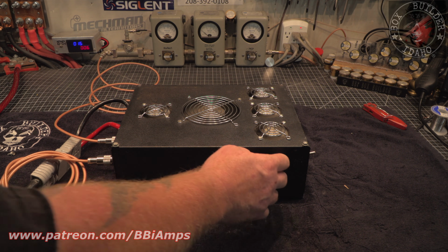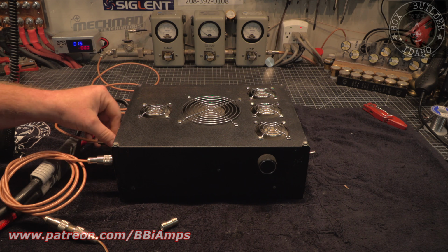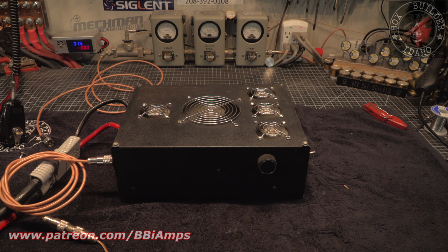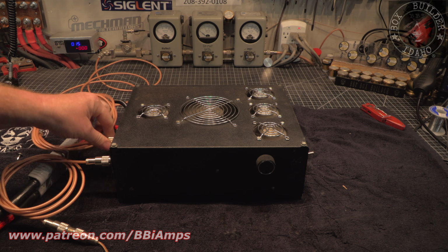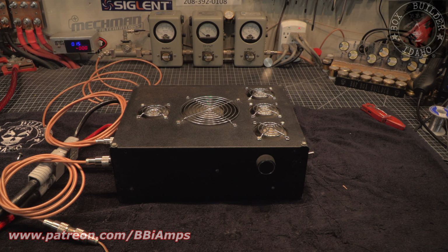Hello, audio. Hello, audio. So it made it worse. Now, in the same equation, let's grab another 6 feet of coax. We're going to ignore how this is all wrapped together, because I know that's not right, but that's what we're going to do. Audio, 1, 2, 1, 2. That helped quite a bit. Now we're down to a 1.3 input SWR.